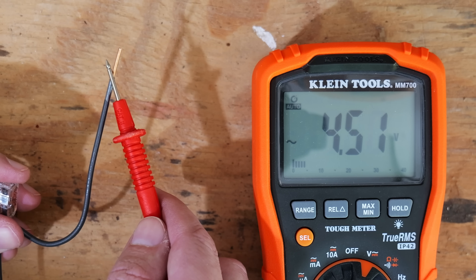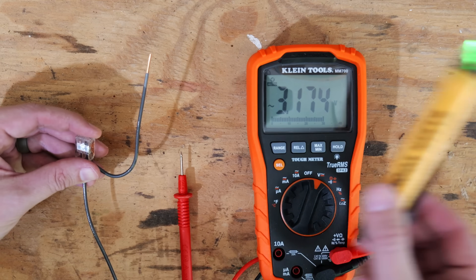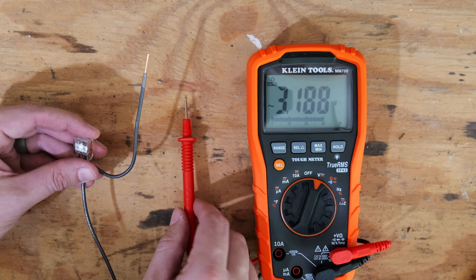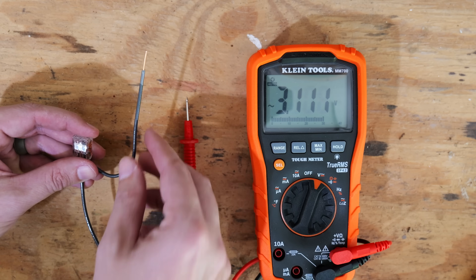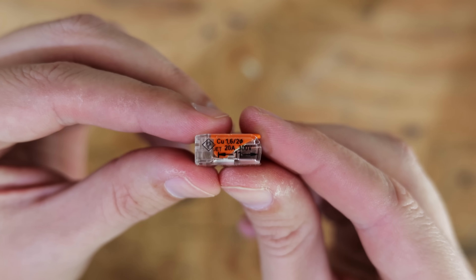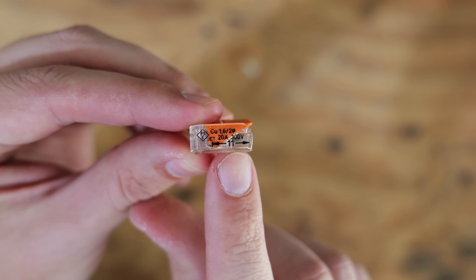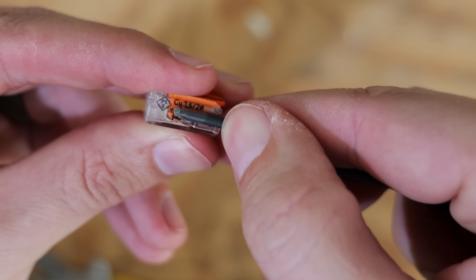The multimeter is showing we're only getting about four and a half volts. So you can have active power flowing through the wires and your non-contact voltage detector might confirm that, but you do not have enough voltage — or at least a consistent enough voltage — to power up the things you're wanting to power. To avoid these problems altogether: if we flip the Wago over to the side, you'll see there's a strip gauge right there. As long as you strip off insulation to be as long as that strip gauge is showing, you know for sure you're stripping off the proper amount and guaranteeing a good connection.